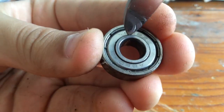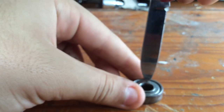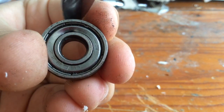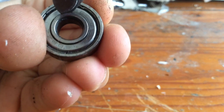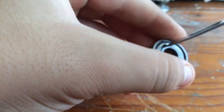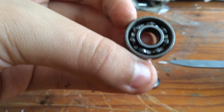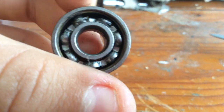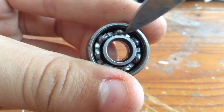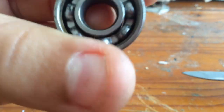You're going to puncture it right there. So what you're going to do, you just take this and puncture it. And as you can see, it gets a nice little hole right there. Once you get the little hole, you can just pry it open up like this — just pry it like this — and you'll get the shield out. This won't damage your bearing at all, because when you're puncturing it you're actually just hitting it, not destroying anything inside. So it'll keep the bearings intact and easy to clean.